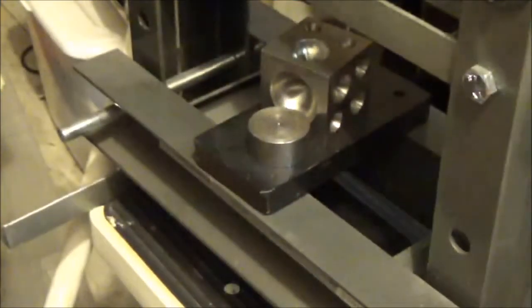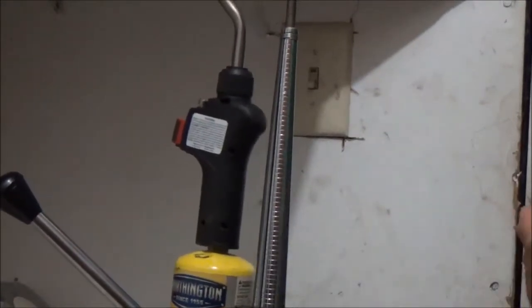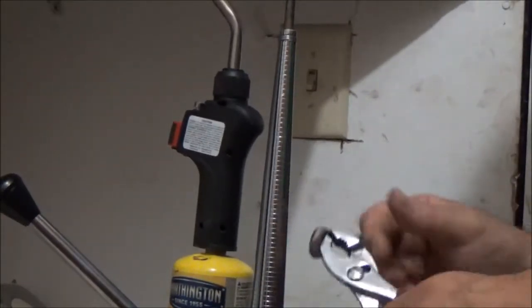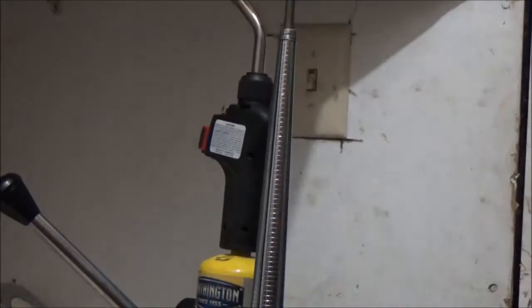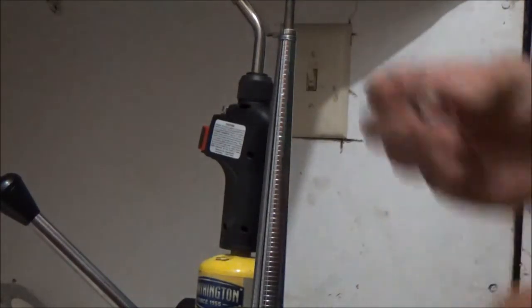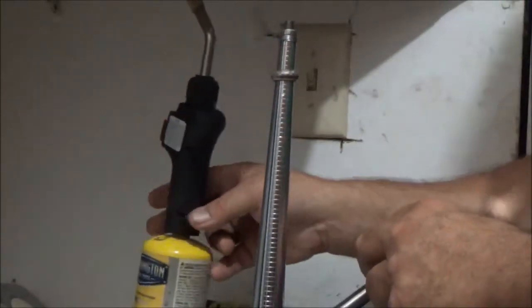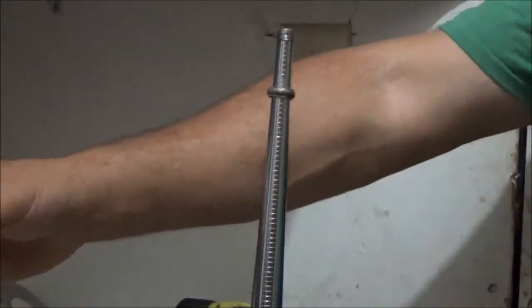Alright, let's go back out and put it on the ring stretcher again. Okay, after squishing this down pretty good, it's going to be a bit work hardened, so we're going to anneal it again. First side I want to stretch out is going to be the thicker side, which is this side. Size 12 all the way down to like a size 3 there. Crazy.